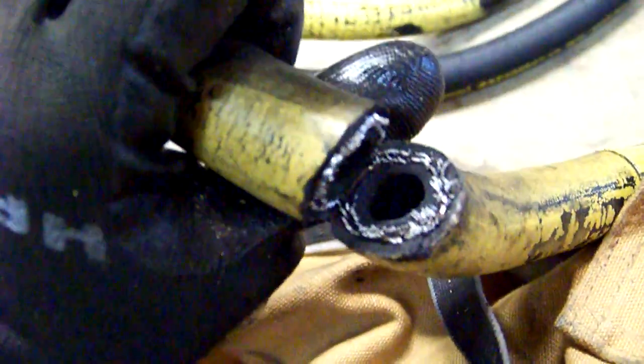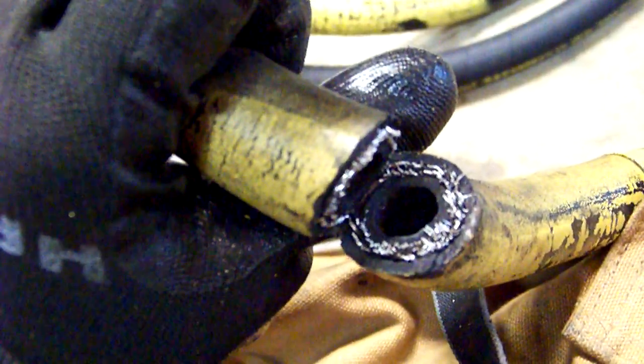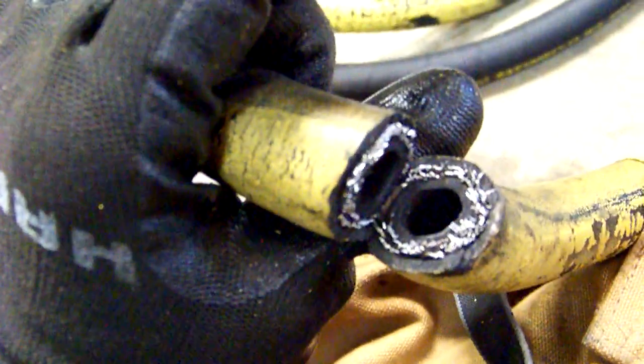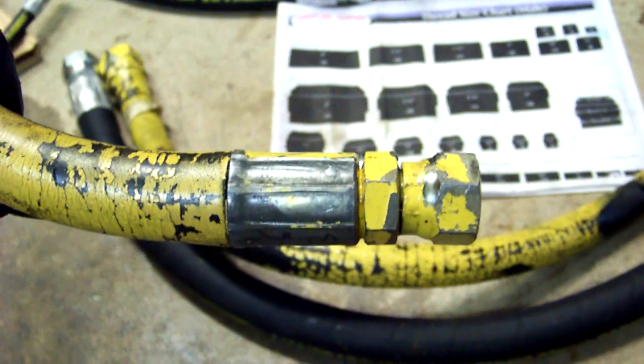Surplus Center sells a quarter inch, half inch, three quarter inch, one inch, and maybe higher than one inch — I didn't need any one inch so I can't remember. This hose has a female swivel — I think that was a dash eight on one end — and a male swivel with an O-ring on the other end. That is an O-ring SAE8 fitting.